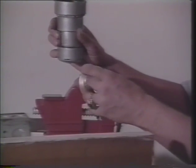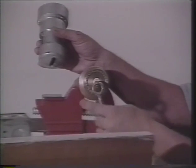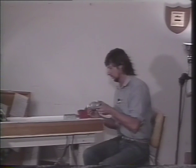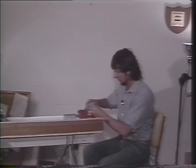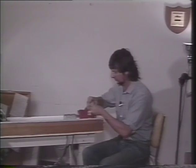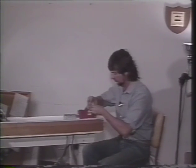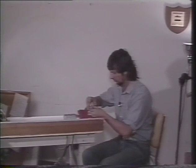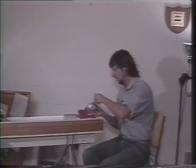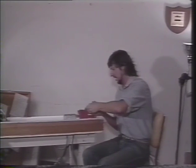This tool uses a blank that's been cut down, slips into the Kwikset. It has an eye bolt on it. To use this device, we insert the blank into the lock, put the pipe over the lock. We have a washer and a nut, which we apply but don't tighten. Then we turn the device a quarter turn counterclockwise.